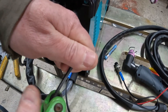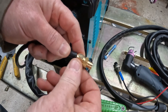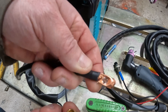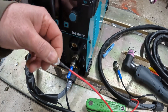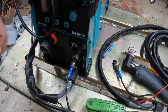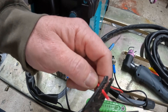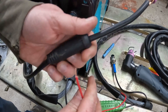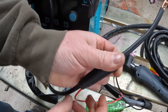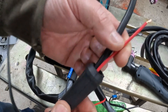You're going to crack this lug free - the lug comes off. Pull it far enough and you're left with the bare terminal. Set that aside, come over to your unit and clip off the end because we don't need that. Then strip the wire back, expose your copper and give it a twist. Get your cable through the boot first, so push the cable through the boot - so you have the cable and the boot together.